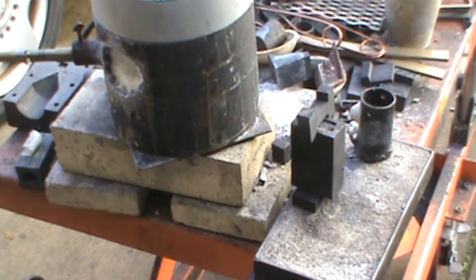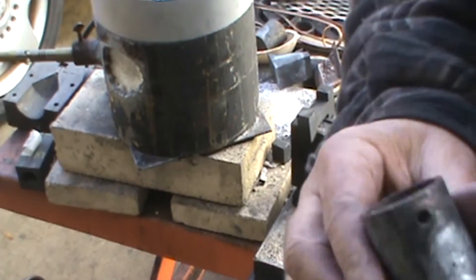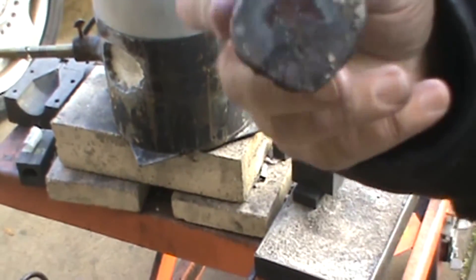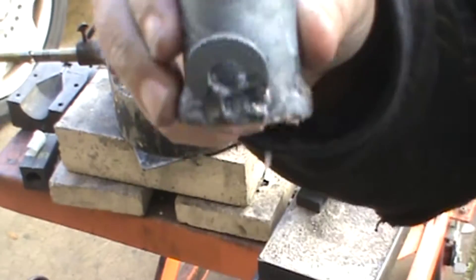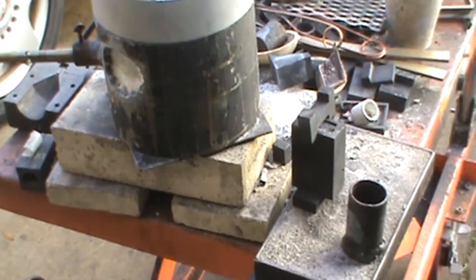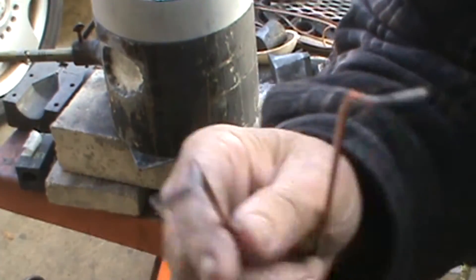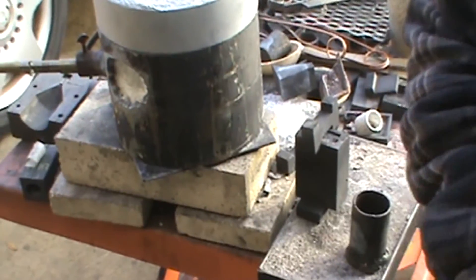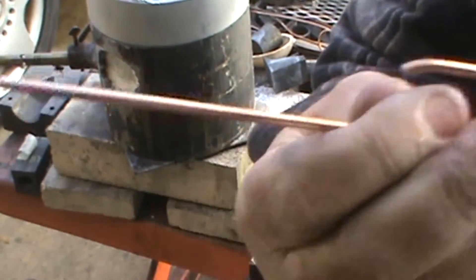Here's a new little thing I came up with. I'm no genius — I got this off of watching YouTube videos of guys doing lost foam casting, and it works out pretty nice. What I made was a piece of steel tubing. I welded a bottom onto it, then I welded a washer onto it. Then I built a little springy tongs. These will go in the holes I drilled in the top of the crucible, and then this is the pour handle.